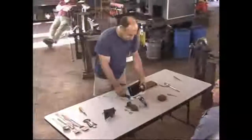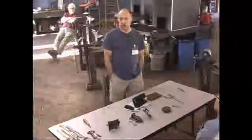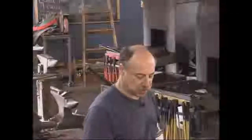Would screws have been hand filed? Screws were made. I've examined a lot of old screws, and I can see three different methods for making wood screws in the 18th century. Hand filing was one, and that was not very common. It was done. They show up most often on guns. A gun needs seven screws. So if you're making a gun, it's not an unreasonable thing to make the screws for it. But screws that were made for installing hardware were commercially made. And they were either lathe turned or die cut with a threading die.